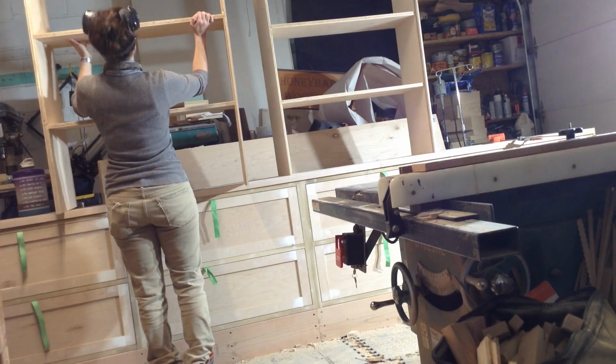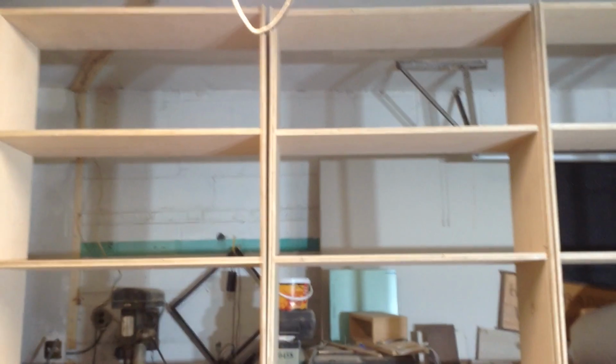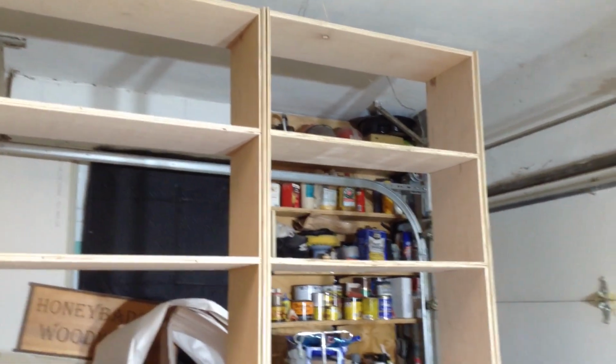At this point, they're very easy to lift. They're not heavy at all. I can slide them all in place, and then I can obviously do all four. At this point, you can see without the backer how unsquare they are. That's one of the reasons I like to use backers. They square up the cabinets, and that will be in the next video.